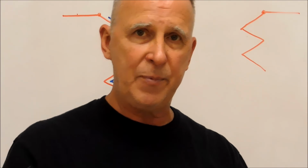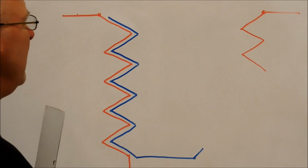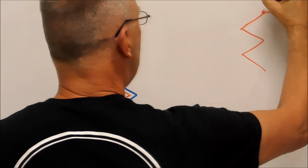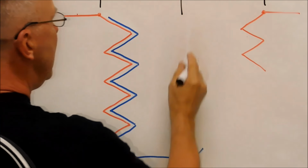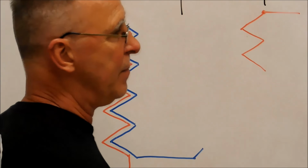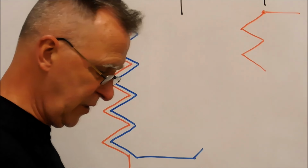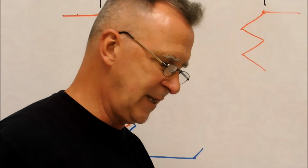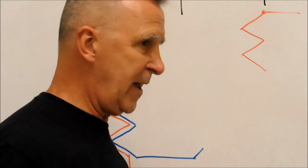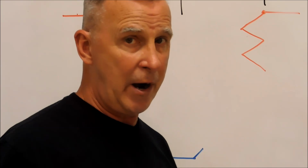So if you can pick up on the countersink right here to establish your center line, you are in much better shape. Now, when you drill the screw out, and like I said, I drilled completely out, I am going to pick a drill that's a little bit smaller than the pilot drill used for the thread that I am trying to repair.